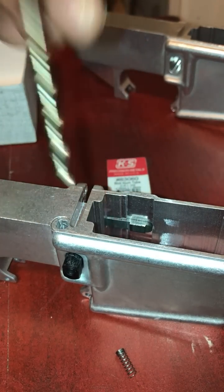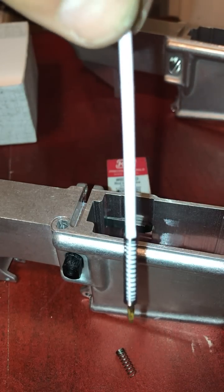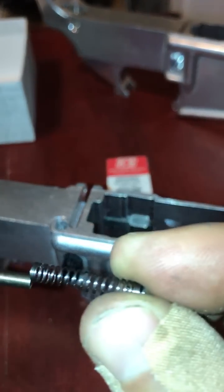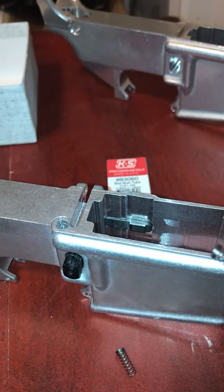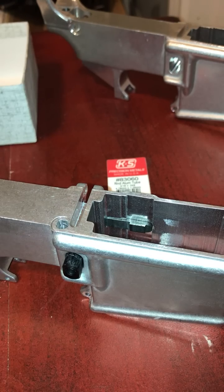First of all, take your drill bit, and I would recommend, make it simple, make it the same size or a little bit bigger so that it'll fit through as a Bic pen insert. The way I figured it out is I took the spring and I found a drill that fit right in it like that. That's the size I want. So just grab your drills and find one that's closest to that. I cut the spring pretty small, because the full spring won't fit in there. Cut it just a little bit more.